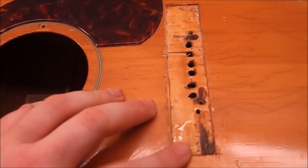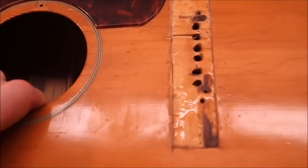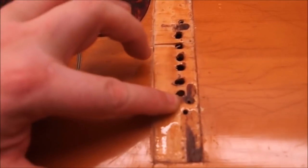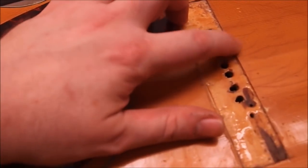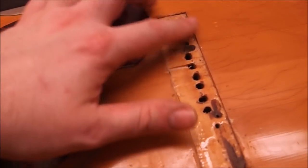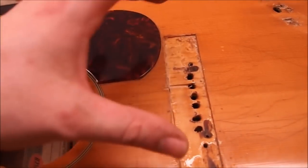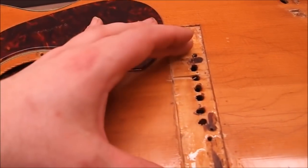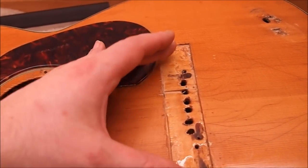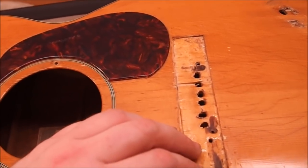The reason it's here is because it's missing a bridge, and it's obviously had a storied history. Something strange happened — there's epoxy residue on here. There's a lip, a mighty lip. It's not just the finish that's been cut back, but the spruce itself. It's almost as if someone took an X-Acto knife, went around the bridge, and chiseled out the spruce to inlay it into the top — maybe trying to avoid a neck reset and not wanting to shave the bridge. They tried to sink it down in the top. Weird.